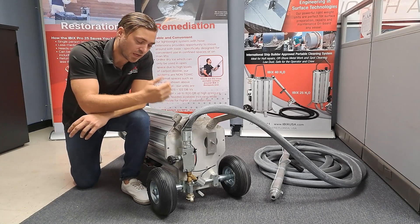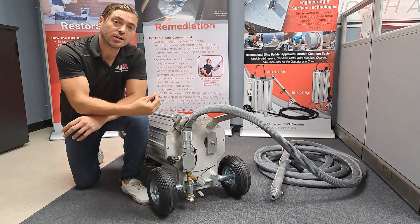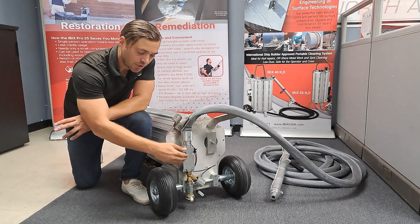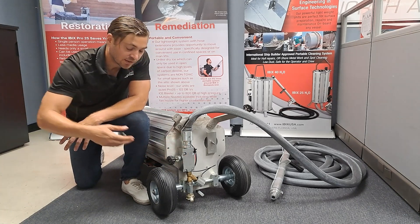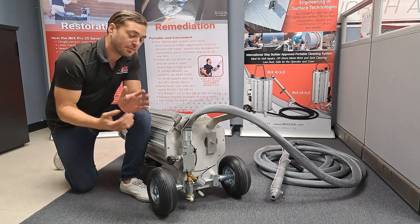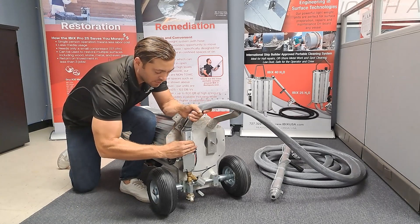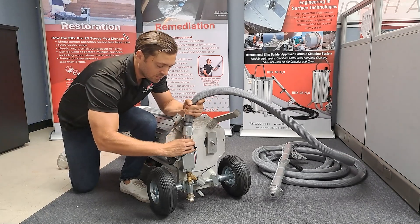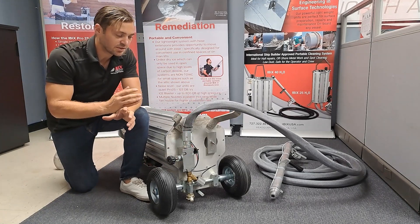At the bottom of the machine where the hose connects, this block is called the abrasive valve — it meters the amount of product going through the gun and hose. Turning it clockwise will shut off the material entirely; turning it counterclockwise opens that passageway and allows more material to flow through. In addition to the abrasive valve, we also have a female-to-male quick connect, which allows you to detach the gun quickly on the fly. All you have to do is pull back on the ring, pull the hose, and you detach it entirely. Once you hear the click, the gun is reattached easily and fast.